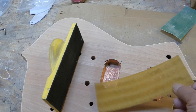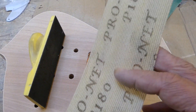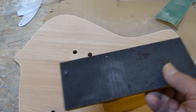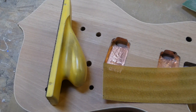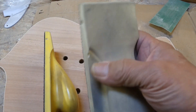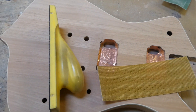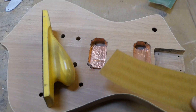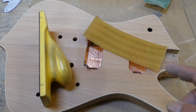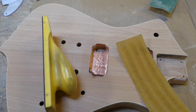I've been running through a lot of sandpaper trying to go through this and make stuff work. This stuff here — you can see right through it — it's called Wonderweave, and it comes with a Velcro backing. I got a special hard sanding block for it, and there's also a flexible one. So if you're doing around bends and stuff like that, it's super flexible. I use it for going around here on the bends of the hips of the guitar. It works really well and it just really moves the wood out of the way — so much better than all the traditional regular sandpapers. But it doesn't work so good on smoothing out paint and finishes. For doing this part right here, I was wasting my time with that other stuff.